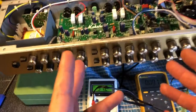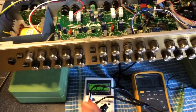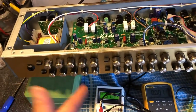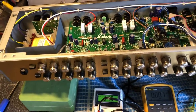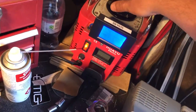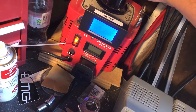If you bias that at 70% exactly, or hot, or very close to hot, and you get a higher wall voltage, your amp is going to be running way too hot, and you could pop valves. So always go a little bit conservative. People go, oh no, you can go more, but trust me, do you want to be going through power valves every day? Seriously? So this just takes care of those places where the wall voltages run just a little bit higher than most.